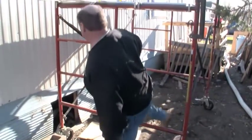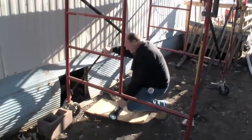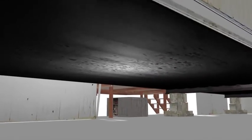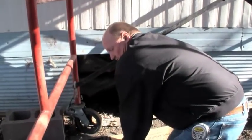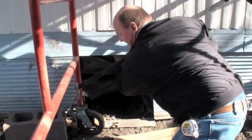This is an access hole here where we can get underneath and check that insulation. I take a screwdriver with me and a flashlight, and I get up here to the belly itself. I take the screwdriver and I just make a nice little hole up in the belly — not too big, doesn't require a lot of patching.